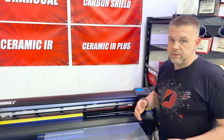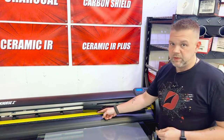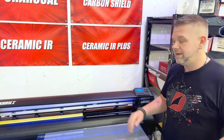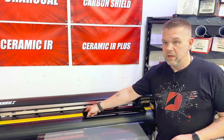To recap the front machine settings: gram force between 60 and 70, speed between 250 and 300 millimeters per second, cut strip in good condition — or put a piece of tape on top for a fresh flat cutting surface. Tensions fully released, rollers centered. Now let's get behind the machine and look at one more thing that can cause problems.